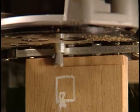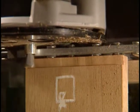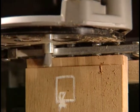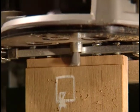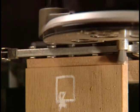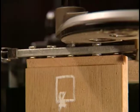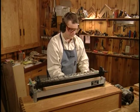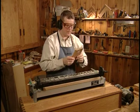Only the tip of the cutter should be cutting on the first cut. This back or climb routing leaves a very clean shoulder on side grain. And finish left to right, with the guide bush touching the bar. Turn the test tail board around in the jig and route the other side as before.